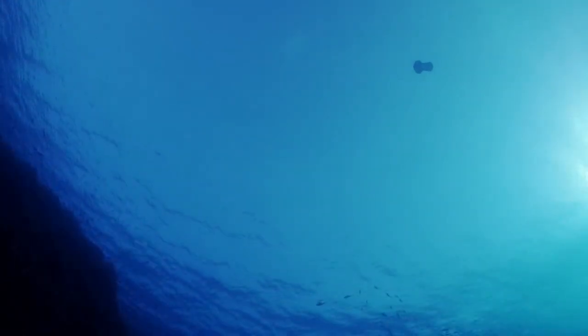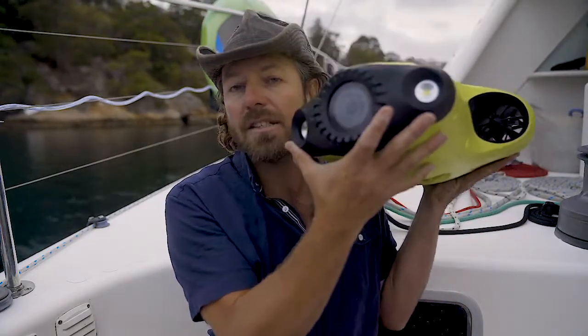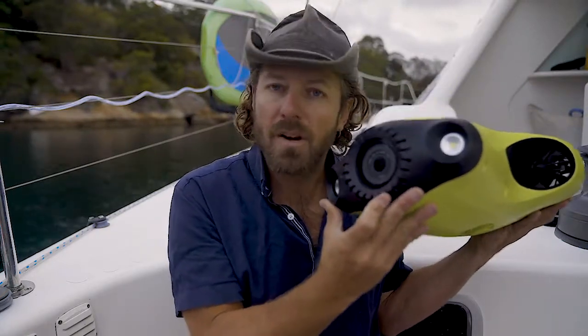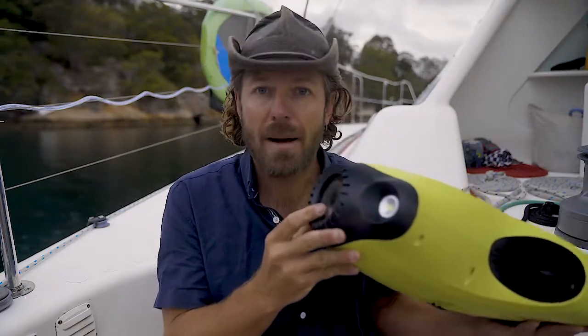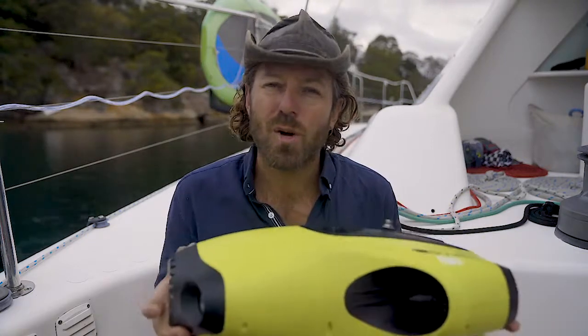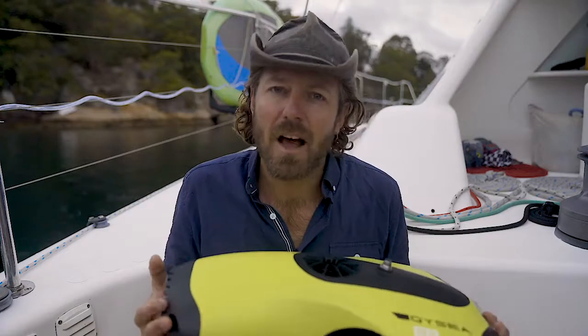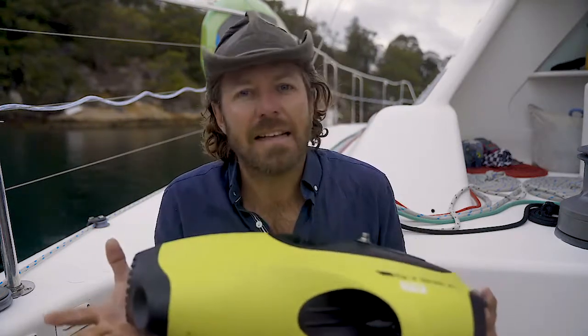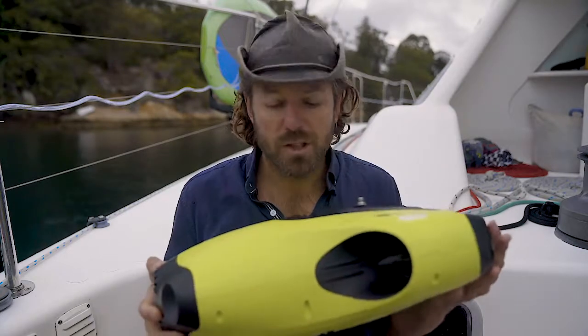The reasons I picked this ROV: the lights at the front are a good distance apart and nice and strong. The camera was very important to me because I'm an underwater cameraman — it's a Sony camera with a one-inch chip, a really good proven type of camera. The one-inch chip means very good low-light capability — you're not going to get muddiness and graininess when the light starts to drop the deeper you go. A good low-light capable camera is really critical in an ROV.